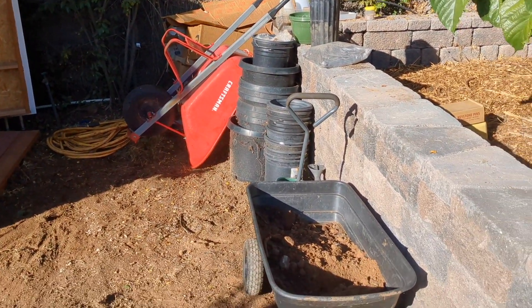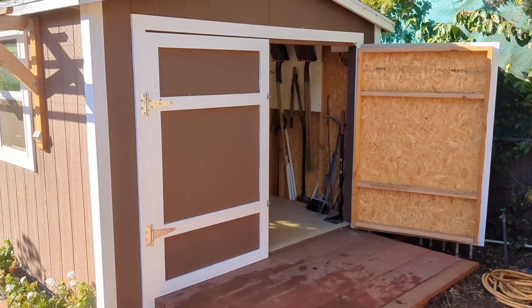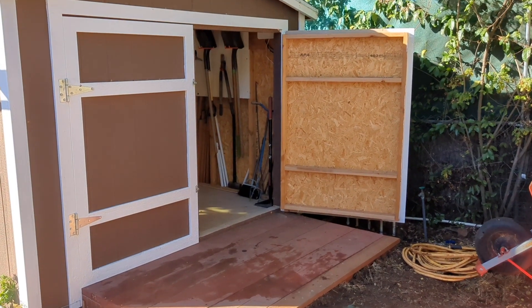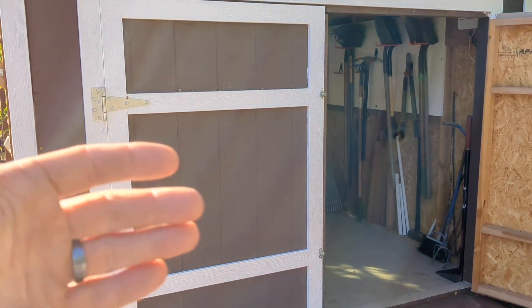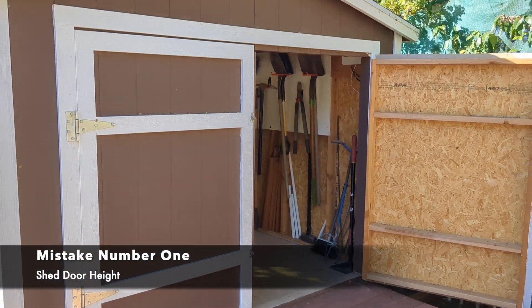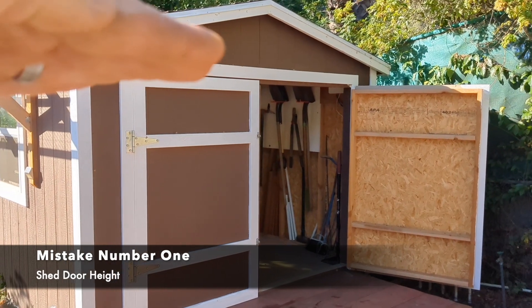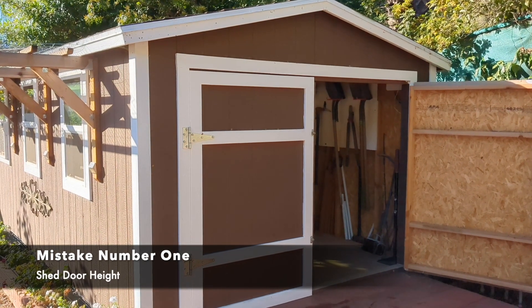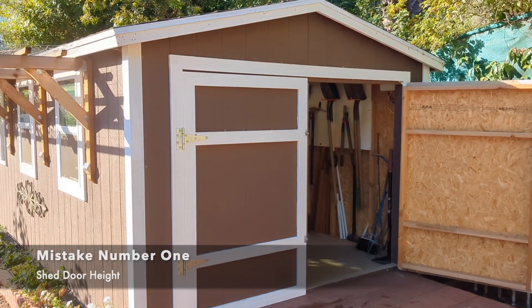Over here I put two doors on the front, and I thought this would be a great idea. The doors take up approximately seven and a half feet of the ten-foot width. I thought I'd have one active door I use all the time and then a second door I'd open to access both sides of a shelving unit. In reality though, if I could do this over again, this was mistake number one. By making the doors so wide, the header had to come down to fit underneath the joists of the roof. I would have gained extra clearance had I had one door in the center.